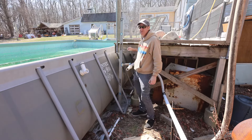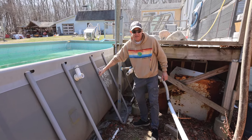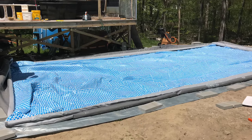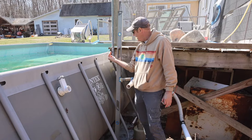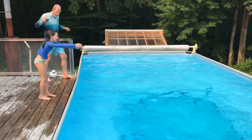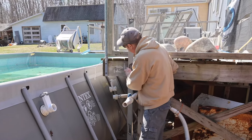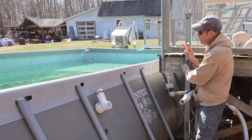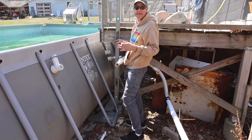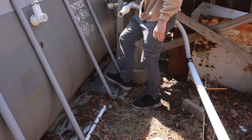When I put this pool up, this deck was already existing and I needed to match the pool to the deck. I had no way of knowing where to actually put these pieces because remember it's all flat and you don't really know where it's going to end up. So I guessed and I guessed wrong. This wall actually comes up, hits the deck, puts quite a bit of pressure on the deck, and then bends over this way a little bit. I wish I knew what the plumb line would have been. Right now I can tell you that line is about here, and it needs to go about two inches that way — that's how far the deflection is off the edge of the deck. My best guess is that if you measure 12 inches over from the top of your deck, plumb line down, that's where your support should be.